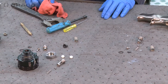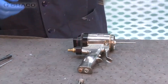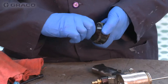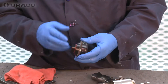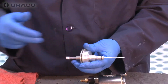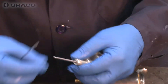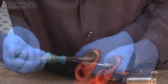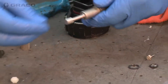That's the fluid section. We can get into the air section. If it needs service, we can remove the rear cap and safety stop. If the red band is showing, that means the gun is engaged. If the band is hidden, that means the safety is on. We have the O-rings on the air piston, and there's a spring that holds the tension on the purge rod and also an O-ring there. We want to make sure we replace this O-ring, which is also in the kit.